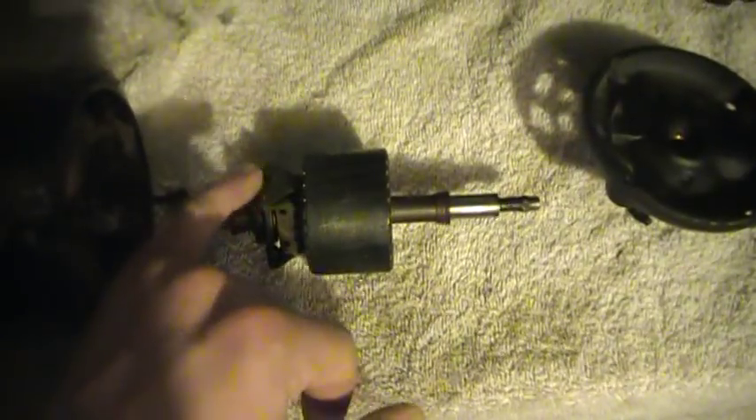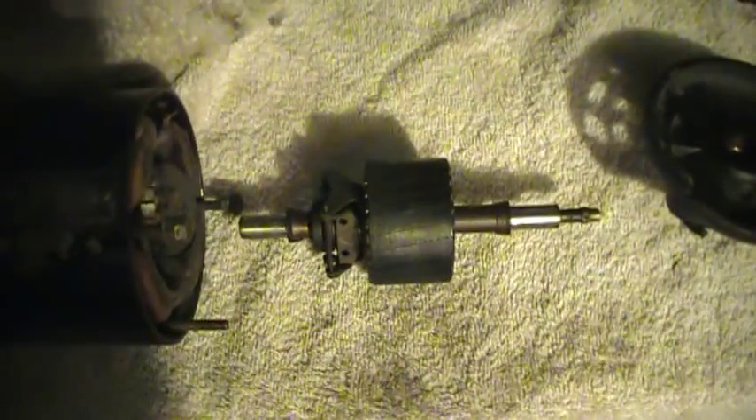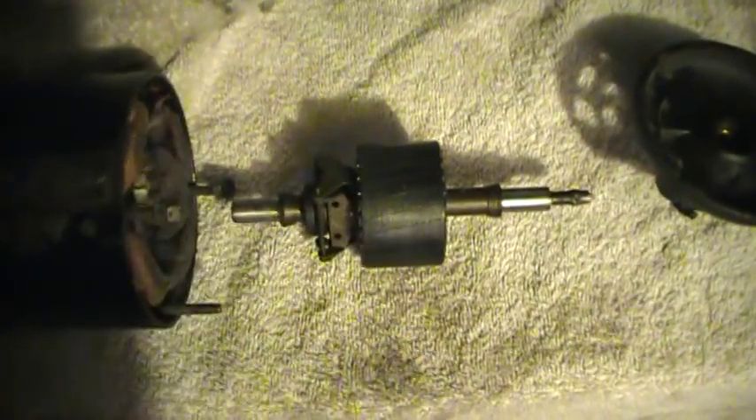Like I said, I'm more than halfway into it. It's got an armature with centrifugal weights and a collar that activates the switch — hence split phase. And then you've got your bell housing and your clamps to hold the motor down. We're just going to clean it up, blow it out, put it back together. Easy peasy.